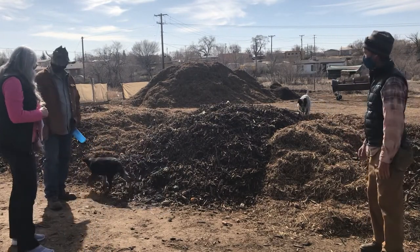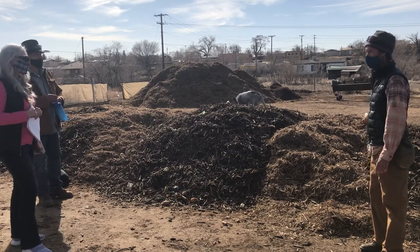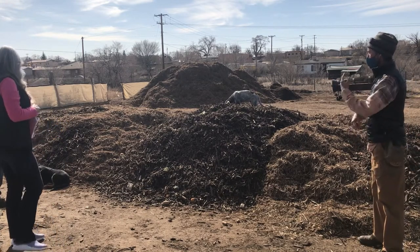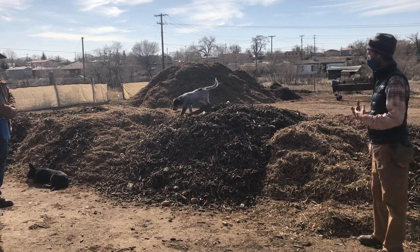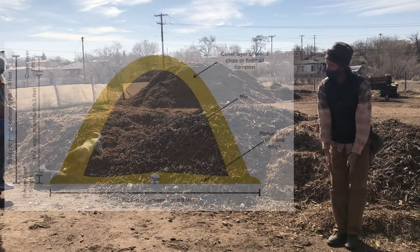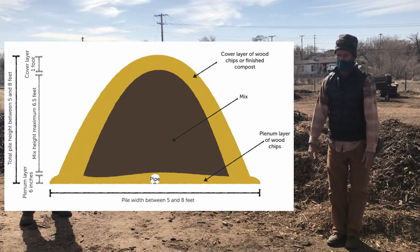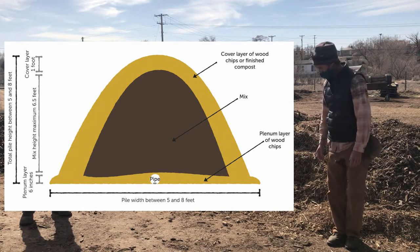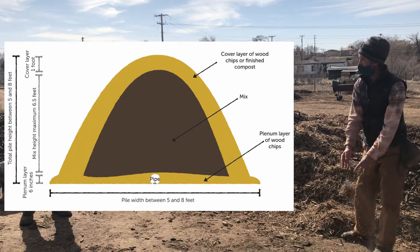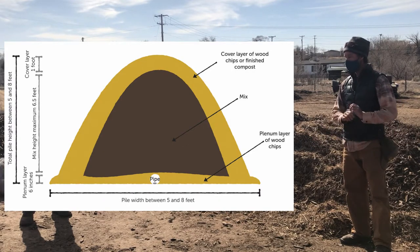We have our fire hose, which will be used to water this material. Our front end loader will be doing the turning — typically two rounds of watering and two rounds of turning to bring the material up to moisture. This would be row one of this new system. There'll be a perforated pipe running from that manifold, 40 feet in length. When that perforated pipe gets placed down, we throw a mulch layer over top of it — it's called a plenum layer. That layer of mulch over the perforated pipe allows for even air distribution before it rises up to meet the wetter, denser raw material for composting.